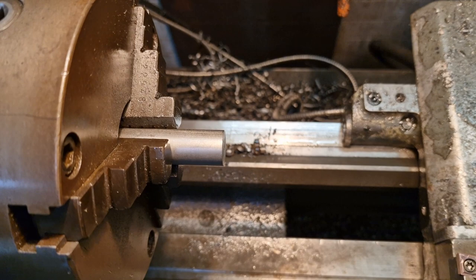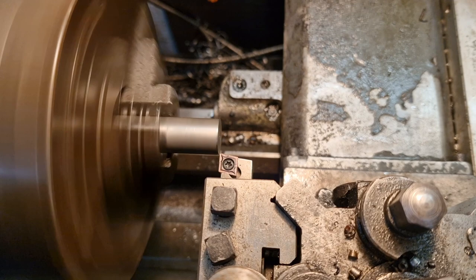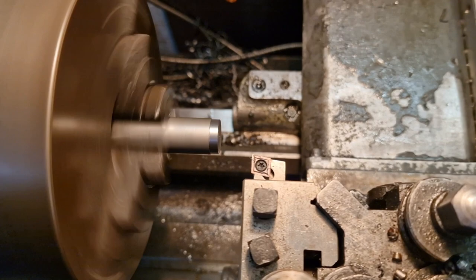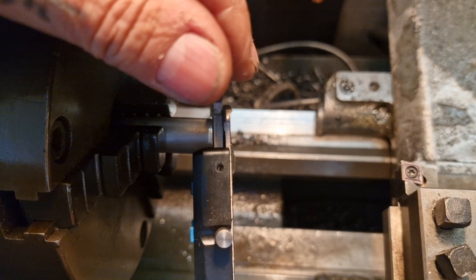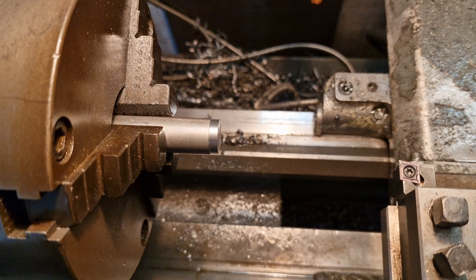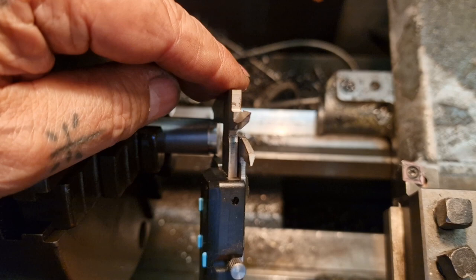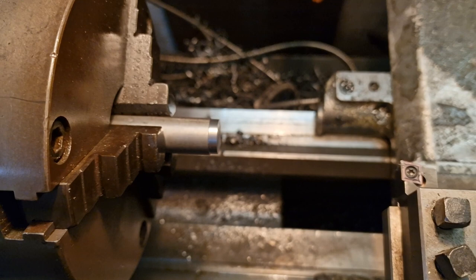So we'll take a clean up pass, new tip. How about there, look? And now we'll check what size that is. I don't want to, oh, I think the radio's quiet enough that I won't get a copyright strike. We're at 17.7, which is considerably bigger than we need. Let me double check that. No, we're not. 17.15. Bollocks.